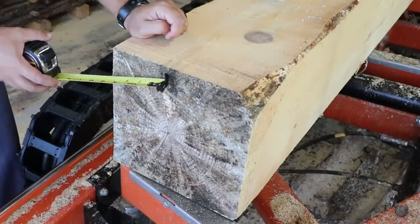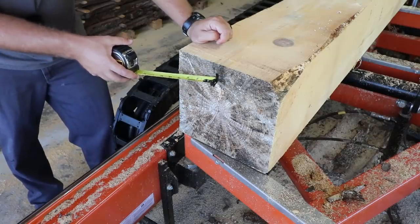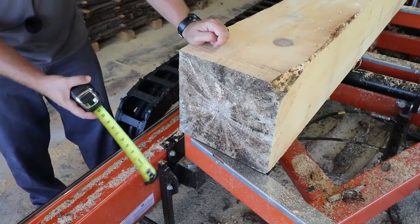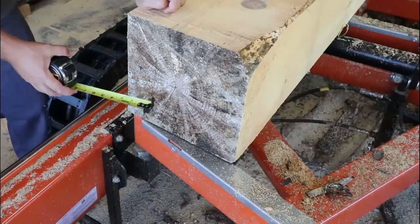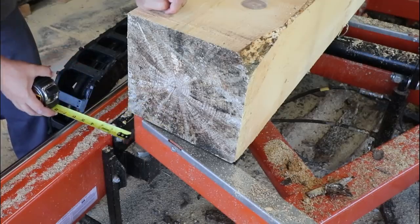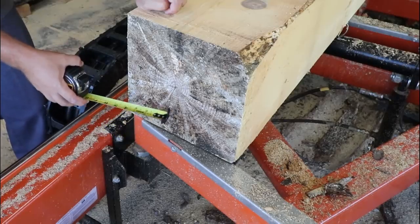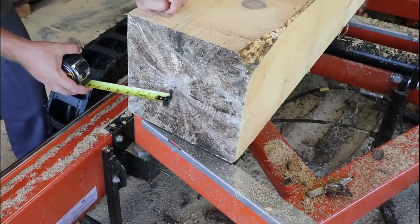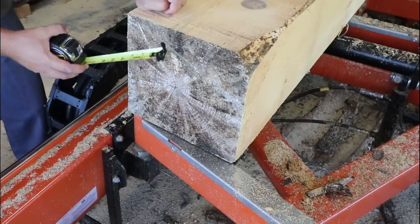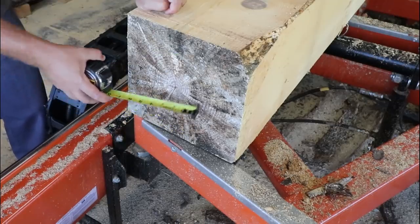And then I'll come on up until I get squared up here on top to make a cut. And we'll probably get 1 or 2 boards off the top of this. They'll be, gosh, almost 11 inches wide. So it'll be 2 decent boards here on the top. And then we'll stop what we're doing. We'll flip it over and put this on the top. Do the same thing. And we'll have our 8-inch cant right here, or our post rather, with the thickness that we want. And this right here should be directly in the center. And then we'll turn on these sides and do the exact same thing. And we should get maybe 6 boards total off this, not counting our 8x8 timber.